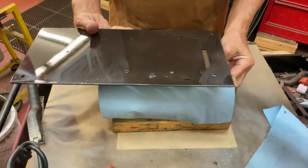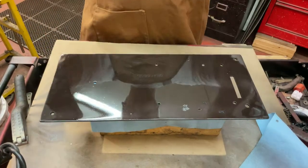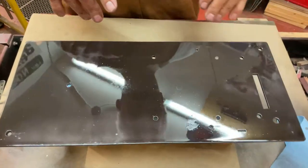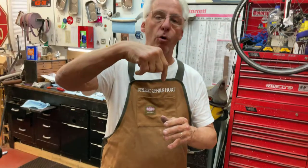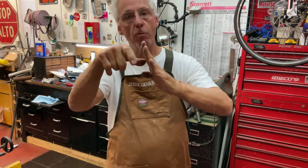When Edison made these, they used a punch press, which means they set this in a machine and it went kaboom, and then they chamfered a few holes and did a few things. But when they punch press them, it leaves a burr — like when you drill a hole, you get this burr out. And when you paint, this is really minute, the burr — when you put paint on, the paint rolls off the burr and builds up around the hole. So you have to have this smooth.